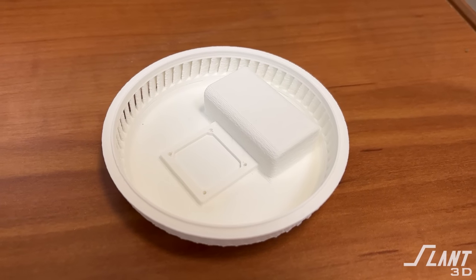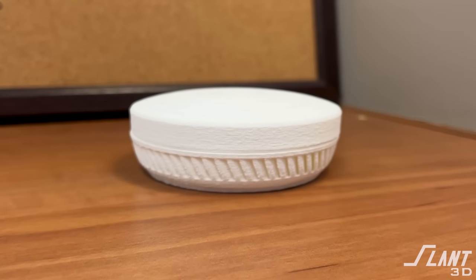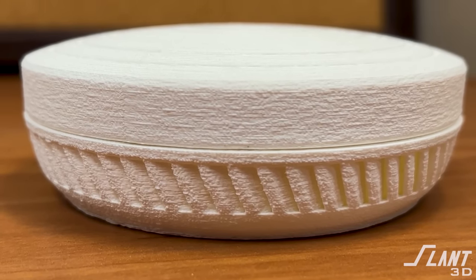This is all printed with virgin 3D printed layer lines at 0.2mm resolution, which is generally fine for most consumer and definitely industrial applications — though for industrial use we'd probably go down to a draft layer height. If you don't really like the 3D printed look, we recommend applying a texture. We use basically a popcorn orange-peel look, adding a little noise to the outside of the part, which gives it a very matte, fuzzy look. This is much more forgiving in production, saves cost, and creates a uniform look throughout the part without a visible transition point between the side and the top.